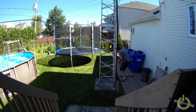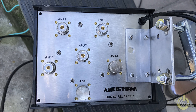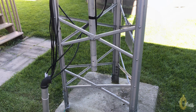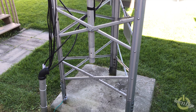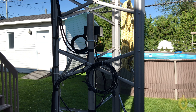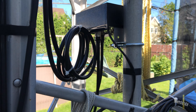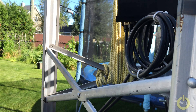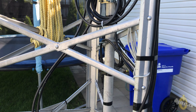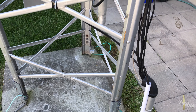I'm working on the pole to install the RCS-8V on my tower. As you can see, I put some caps on the antenna ports that I won't use. Here's the cable inside, and it is mounted onto the tower. With the tower brackets it was difficult to install on the X — the U-bolt was too small — so I just built it up like this. I did the lightning loop as recommended in the manual. You can see I intercept my coax and it's all installed about six feet above my height, so I don't think there'll be snow over there. I always put some black electrical tape onto the connector when I'm done just to make sure there won't be any water inside.